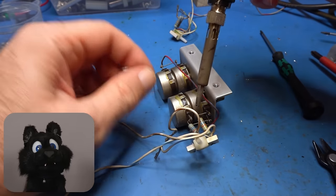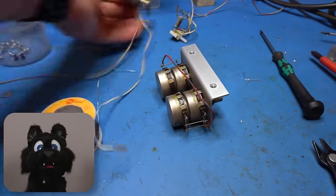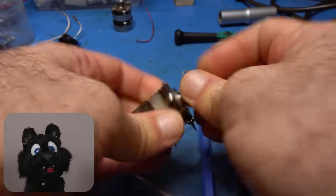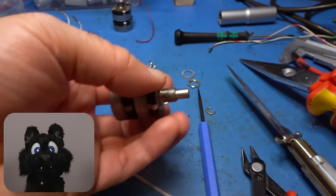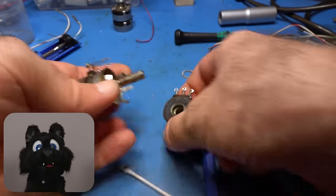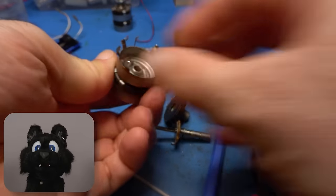The horizontal and vertical gain potentiometers are stereo ones. They essentially provide the high voltage supply to the final stage of the CRT driver. I think it's done like this for better symmetry when adjusting. But the disassembly is annoying. At least until you discover that the shaft is just pushed into the rear wiper and can be pulled out with mild force.